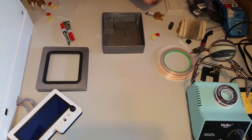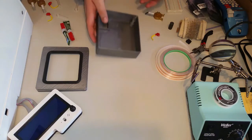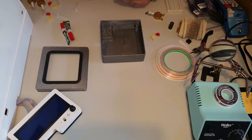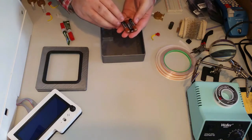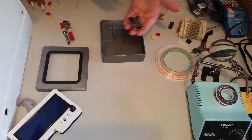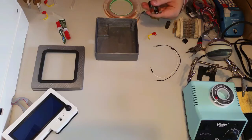I've worked in a slot here for the batteries to go into and it'll fit almost perfectly. Three AAA batteries, but since we're going to be wiring them in series and not parallel, we have to do some funny things. We want the power to come out this side and the ground to come out this side. I'm gonna take these three batteries and flip this one upside down so the ground is here, power is here, I connect these two and then connect these two and we're good to go. This is where our copper tape will come in handy.